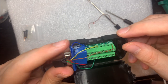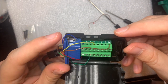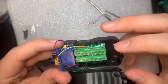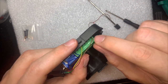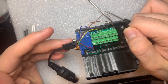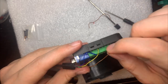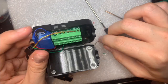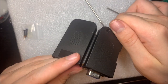So I tried wiring this thing up using this breakout box thing, but I actually find it way more annoying than just soldering it. I guess people will go to great lengths to avoid using a soldering iron, but really this is just so annoying. Each time I try and screw this in, it's really hard to get a good grip on the wire, and so it just falls out each time. Maybe I need to use a thicker gauge wire for this to be effective or something, but using these thin wires, it's just such a nightmare to get these to hold. I managed to get one ground wire held, but wiring up every other ground wire like this is just going to be a nightmare.